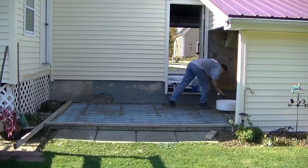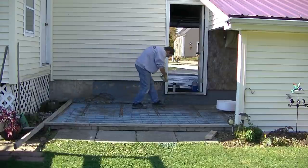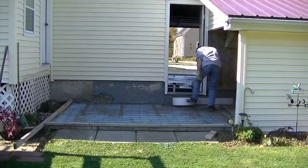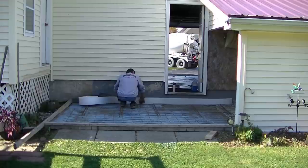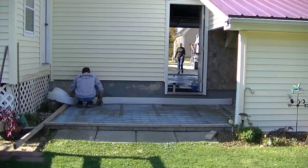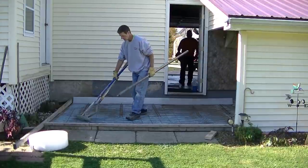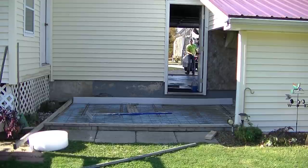Now what I'm doing with that white roll — we call that ISO strip. That's an isolation strip piece of foam. I'm going to put that up against that old foundation. You can see how rough that old foundation is — it needs some patching done too, and we may come back and patch that later. But that ISO strip is going to keep this new concrete from bonding to that old foundation. We want to keep this separate because there's less of a chance it'll crack if we keep it separate and don't let it bond to that old foundation — keep it isolated. That's why they call it ISO strip. It's about a half inch thick piece of foam, and I sprayed on some glue on the foundation and it sticks right to that 3M glue. I'll have a link for that down in the description too.